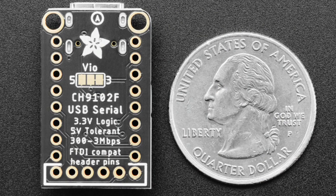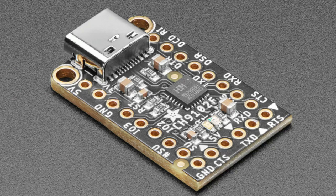It is less expensive than the CP2102s or the FTDI chips, so there's that. A lot of people are starting to use this not just because of availability, but for cost savings, BOM savings. One or two things I do want to mention because they tripped me up.